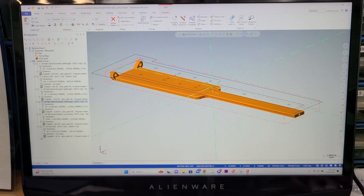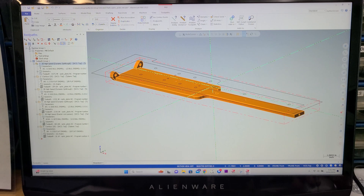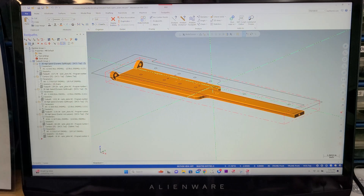Here we see the part first side. First stop, all I did was come in with a 3D high-speed dynamic OptiRough and did about three step-downs, just removed the material that I don't need up there. The only thing that's left is the ears you see over here. After that, we did some contours just to clean up the ends and clean up some vertical surfaces.